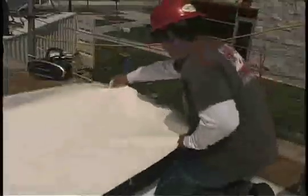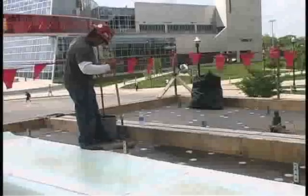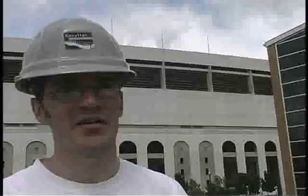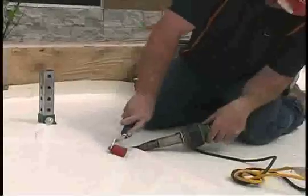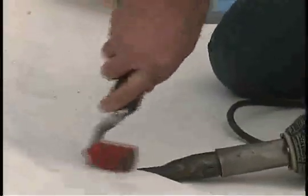The process for laying down the membrane: first you cut a rough piece to size and get it folded over. It's almost like applying wallpaper — you fold it over on itself and do one half, then the other. Basically it's a contact cement product; you roll it on both the roof and the membrane. Once it tacks up, you roll it over and smooth it out with a broom. Once you have the main flat part done, you put a metal termination bar where it turns up the parapet about an inch or so. On the top and wall of the parapet, the membrane comes down and over and then they heat weld it. Heat welding is like a giant hair dryer on steroids — about 1,200 degrees. You stick it between the two layers of membrane and it melts and welds them together.